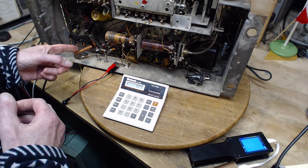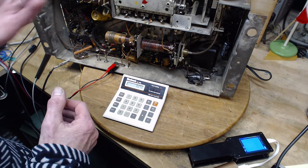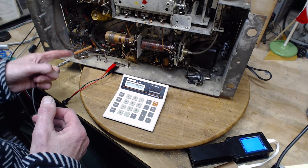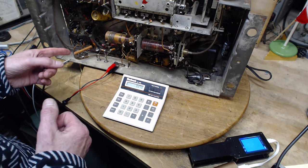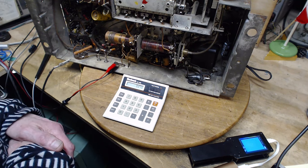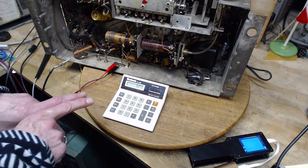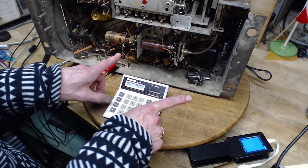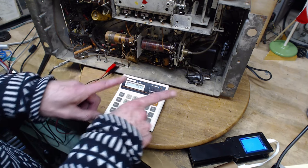Well, if I'm going to try to dissipate 10 watts, then we're going to end up with 5 in the field coil, 5 here. But I put this resistor in, and this went way high, like way high. How did that happen? They're the same resistance. So the power supply is looking at the coil and looking at the resistor and saying they're the same thing, so it's splitting its current. I don't know.